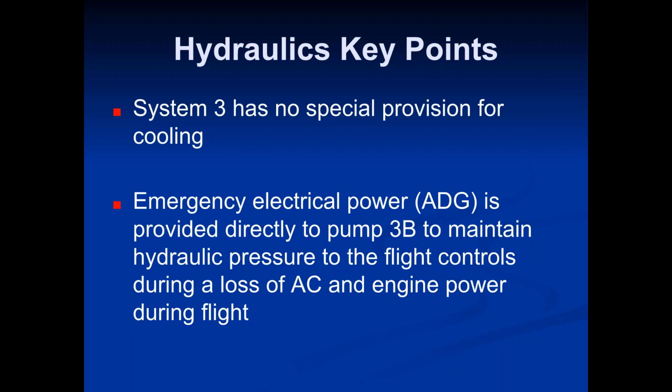So you always have to have two operating. Usually it's the two engine-driven generators, but it's not uncommon to see one of the engine generators out of service or not functioning. And you can fly the aircraft without one of those engine generators working. We can take people on it. We can fly it as a 121 plane. Once we jump into MELs later on, you'll see how we do this.